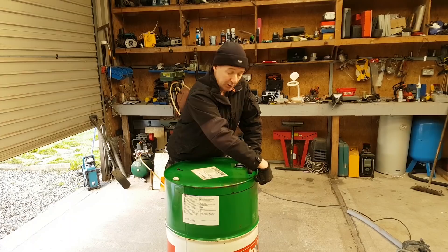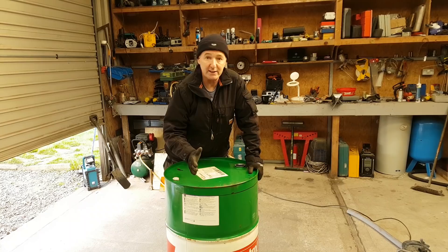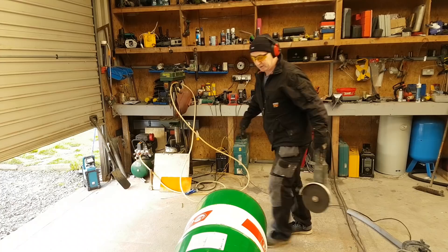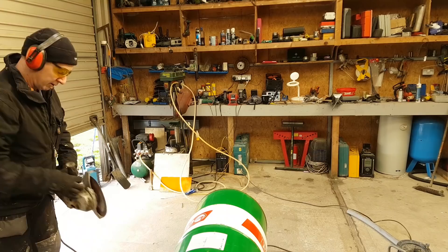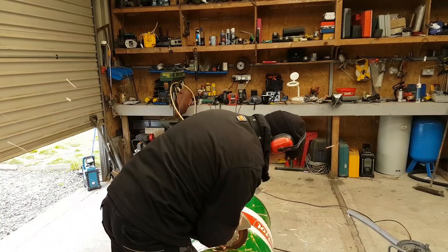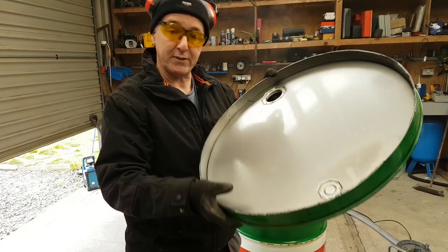What I've done is I've put a black mark at two and a half inches down from the top all the way around, and I'm going to hit it with the angle grinder and take it off. Safety first - I have the lid open on this barrel. I know there was only oil in it, it's empty and there's no fumes, so I'm safe enough to do this. Be careful with barrels because you don't know what was in them. Okay, here we go around the line.